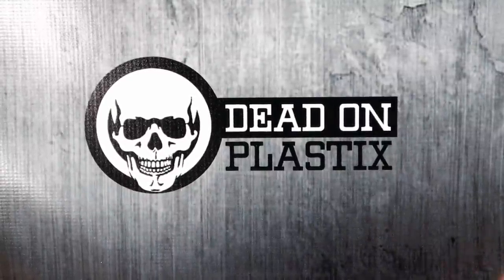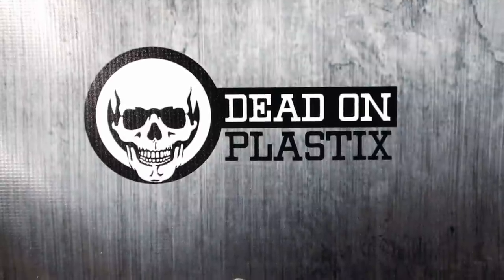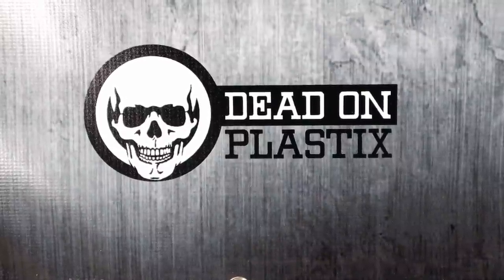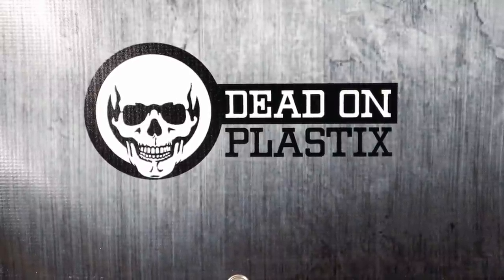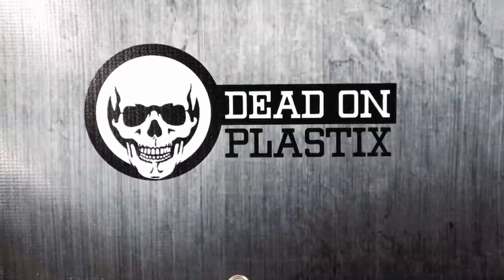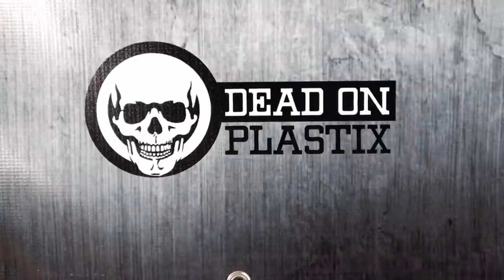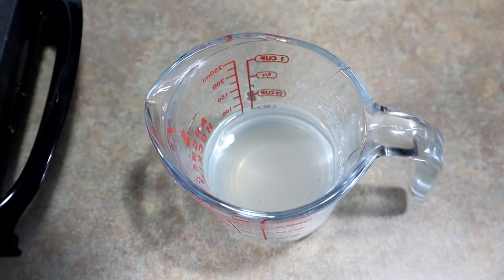We're going to be using Dead On Plastics today — that's the plastic that we choose here on World's Fishing. We're going to play with two different durometers: I'm going to pour some in their black bucket swim bait blend and also do a run in the tube blend — so a medium and a medium-hard blend. I want to see what durometer will work best for this bait since we are going to go test the action later on.